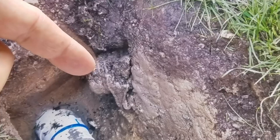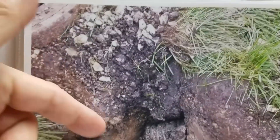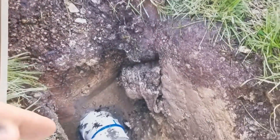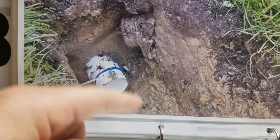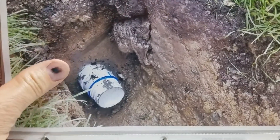This was another failed pipe that went to a pop-up, and then the water was supposed to defy gravity and go up into the storm drain catch basin — which doesn't work. So we core drilled here and then ditched out a really big trench, and I'll show you how we go about building our French drain systems.